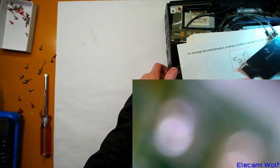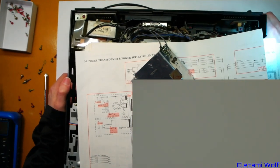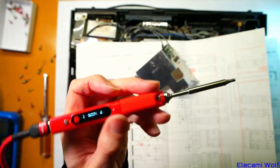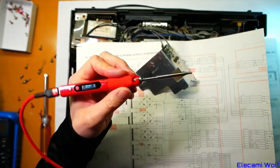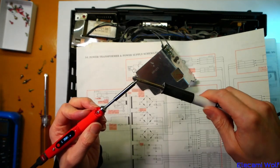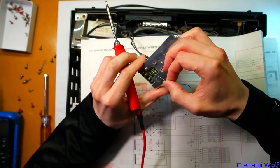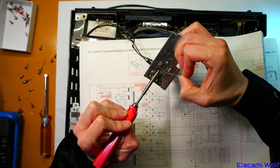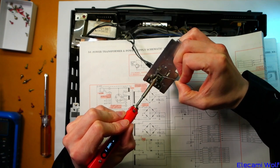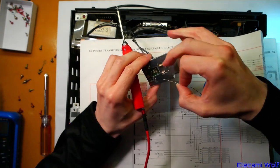I wonder if there's been an intermittent connection on that power supply and that's what burned out the chip on the timer board. People seem to like this type of soldering iron but I'm not really happy with how long it is compared to the Hakko style — the T12 stuff — which gets you quite close to the action. Anyway, we've got to re-solder that. The problem is these things have been sitting there for 20 years or whatever, so the solder has gone all crusty.